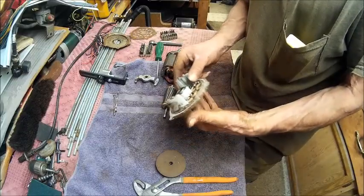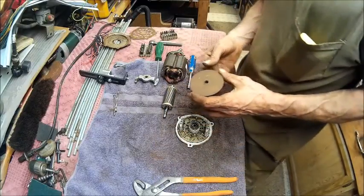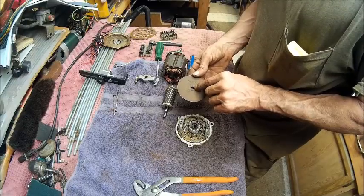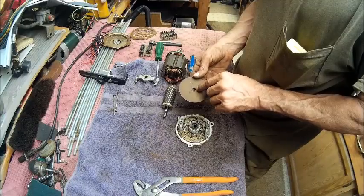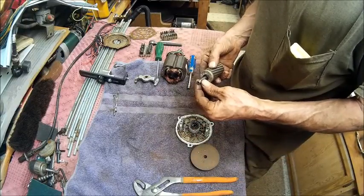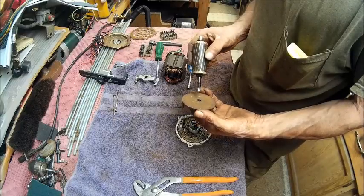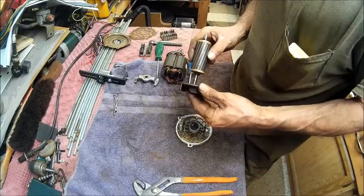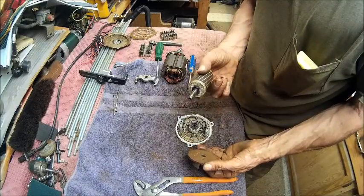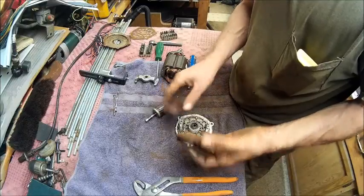All right, well, first thing we're going to do is clean that up. So we know we're going to get it working. I have no doubts I can get it working. It's a good possibility that I can take some plastic epoxy, fill that thing in, and maybe smear just a dab of grease around this part here. This is just thinking. Fill that hole in with epoxy and then press that down on there and hold it flat until it dries. The grease will keep it from adhering to this, is what I'm thinking. And then we can pull this back out, drill the hole back out.